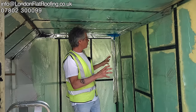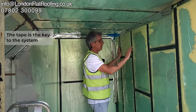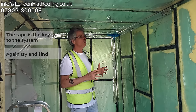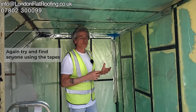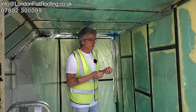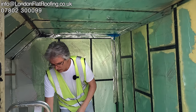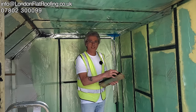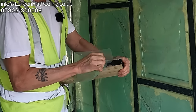If you look at what's going on here, you can see all this black tape. This is a butyl tape. Most systems from these manufacturers use two or three different tapes, and they're mostly butyl tapes — sold in different variations but nearly always butyl-based. These tapes are really sticky. Here's a piece on a piece of wood — not only does it stick to stud work really well, but look how it's grabbed hold of that. It is really sticky.